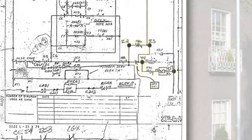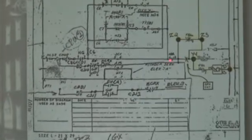If you look at a terminal, let's say you look at ASR 12 contact. Can you guys see that? You can see that? Yeah. Okay. Now, if I had to open the ASR 12 circuit, what I would do is take all the wires that I find on that contact. Might be 1 wire, might be 2, might be 3. We don't know how the wiremen in the factory wired it. But I would take all of them off, and move them to this side of the open. And then put a new wire from Zebra 2 back to ASR.